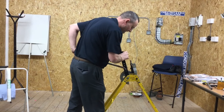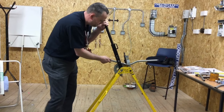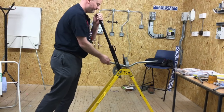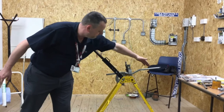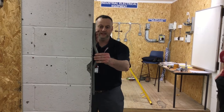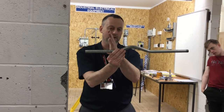Exactly the same hook-in position — I've got it exactly hooked again in the same position. Make sure I'm parallel, and we're going to try and bend back the other leg. Looking from the camera side we can now see whether we're running parallel with the two sides. Maybe a fraction more, then we'll look at it and see where we are. Taking it to a solid surface and offering it up, we're trying to work out whether these two run parallel now with the wall. We've got our crank in position. If they weren't, we'd put it back in the machine and put a little bit more bend in. Remember — I'd like these to be underbent rather than overbent in order to play around with it.